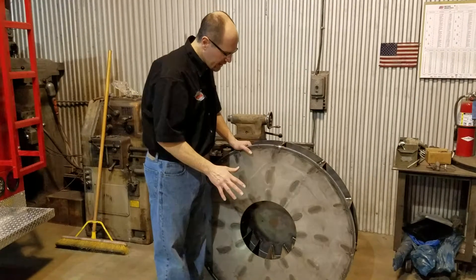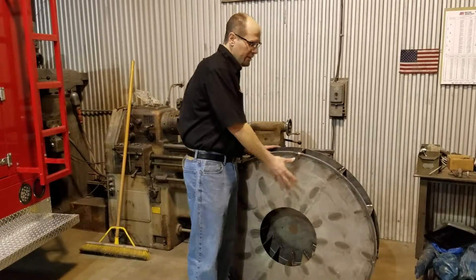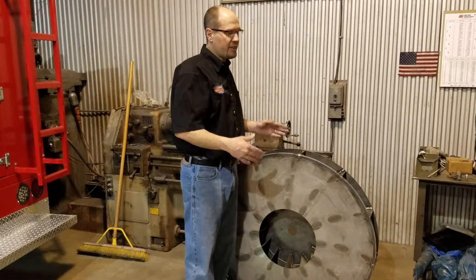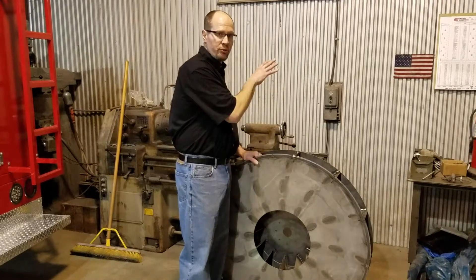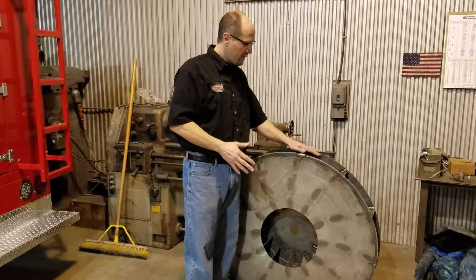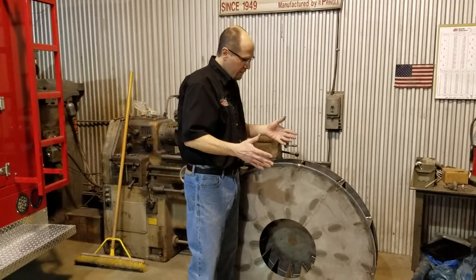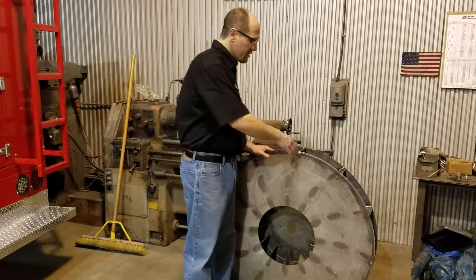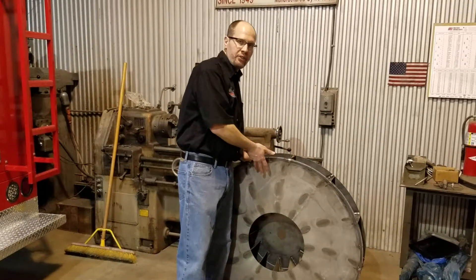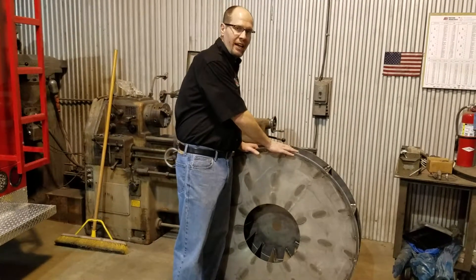A forward curve fan gives you a high CFM number. With the shroud on it, most of our competitors' fans — with the exception of Harold's Powerback — just have blades that stick out without this shroud plate. The difference is that with our design, air is forced to go through the fan. With competitors' fans, if you put restriction on the airflow, air can roll off over the edge of the blade instead of going through it, which lowers your CFM. That's called static pressure, and this fan design has higher static pressure than other designs.